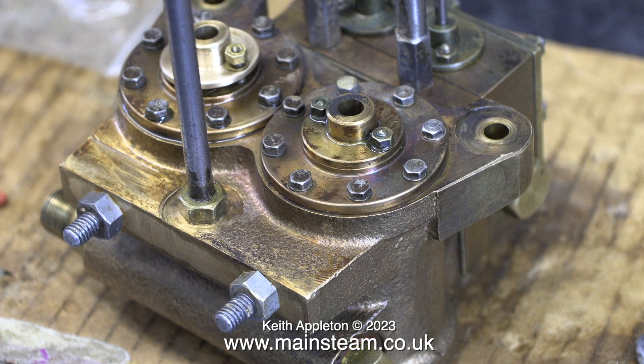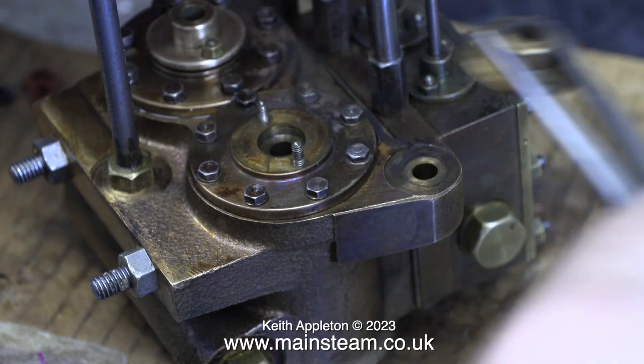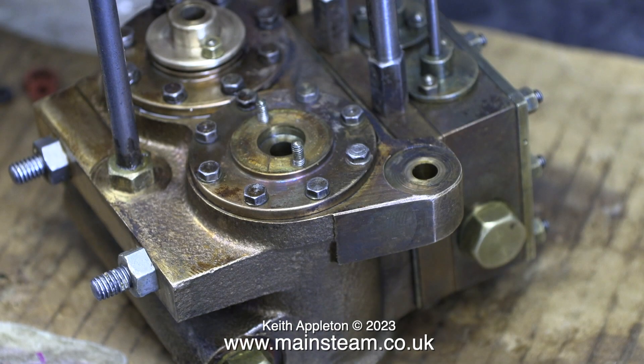Here's a view of the cylinder block with the new clean gland cover in position, complete with a pair of O-rings that you can't see. As far as I can see, the problem is that these holes in the glands have been machined a bit too deep. You could get away by using graphite yarn instead of O-rings. I've decided to try and use two O-rings in each gland, which should be successful.